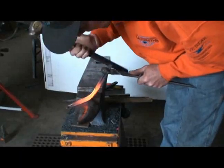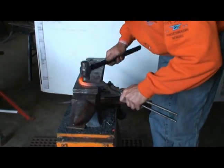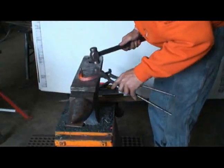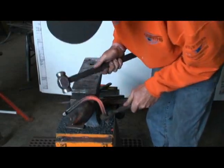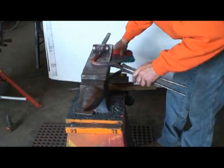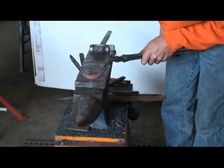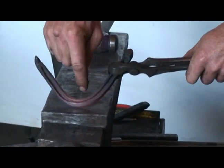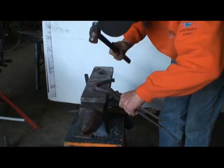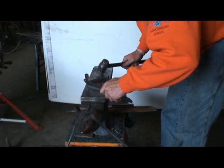Making my toe band — start over on one side, come on over to the other. Try not to hit it at all, just trying to manipulate it. Start here on the end and kind of just bring it all in, bring it a little tighter. You can see, without ever hitting it, it stretches that and it cleans up that toe without marring up the inside edge of your stock. Stamping right behind because I got my measurement. Now I've pretty much got my toe sorted away.